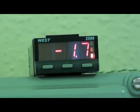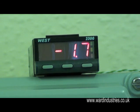The N2300 can be supplied suitable for a line supply of 96-264V AC, or a lower voltage version of 12-30V DC or 24V AC. The type of power supply and outputs required must be specified at the time of order. The N2300 is a factory built unit; unlike the plus series of controllers and indicators, the N2300 cannot be fitted with plug-in output and option boards.